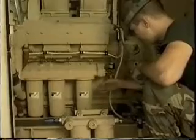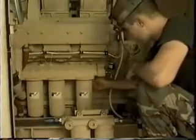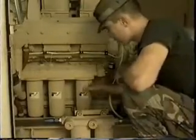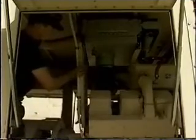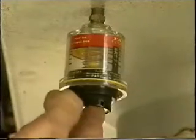The engine crankcase sight glass, or dipstick, must be inspected for proper oil level. Also, check the oil filters, bypass filters, and the oil lines for leaks. Air intake filters need to be checked for proper airflow. These filters can be checked during engine operation using the service indicator scale on the filters.